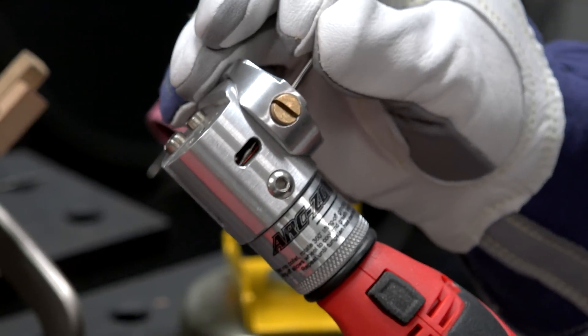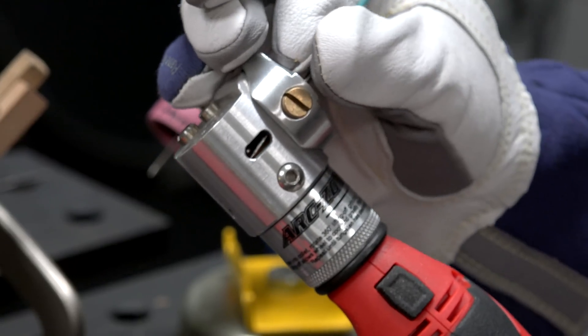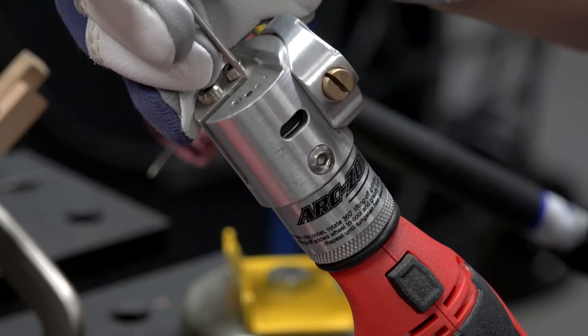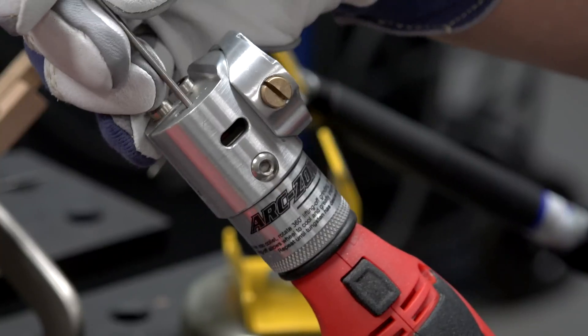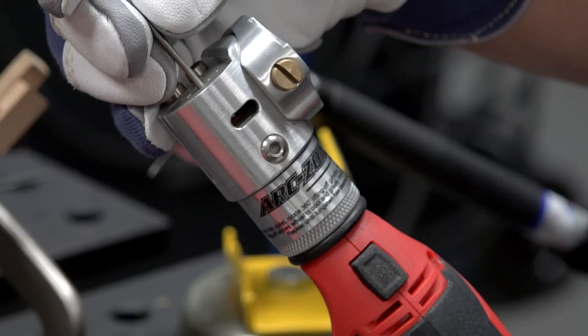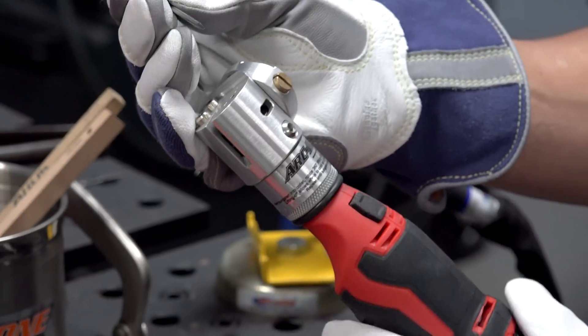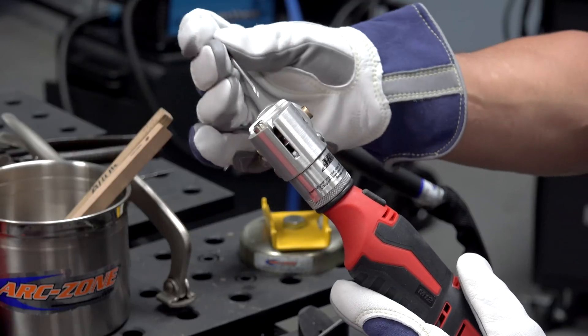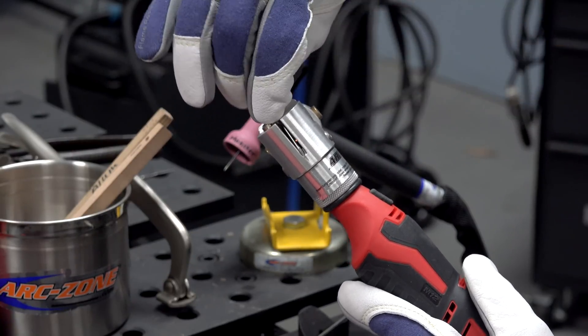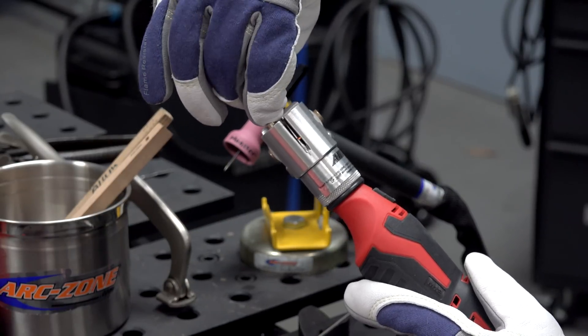The key is to be consistent with your rotation so you don't get a flat spot on the taper. That looks pretty nice — it's got an almost pointed tip to it. I'm going to come into the top of the machine and just kiss the top of the wheel and put a tip flat on the tungsten. Now if you happen to be a shaky jake like me and you get a lot of big balls on the end of your tungsten, you can come in through the side, rotate the tungsten, and cut it off.